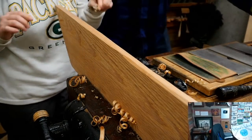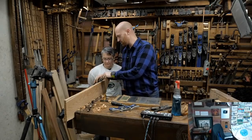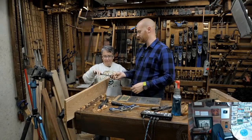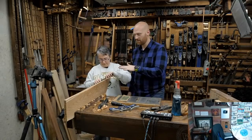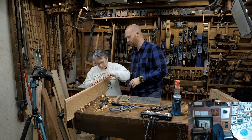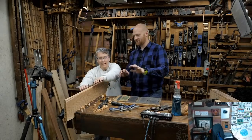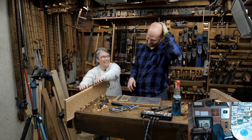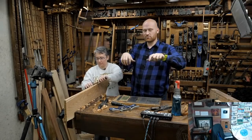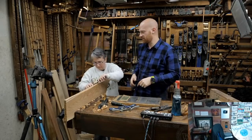And the problem with spokeshaves is they tend to get addictive. Okay. So here, let me show you some of the differences. Because this one, as long as the sole is on there flat and you push it forward, it makes really happy little curls. Then this one's round bottom. This is where the fun happens, because this is far more versatile, but it takes far more control. Like that? Yep. Ooh, I'm impressed. She gets it first try. She's got some control. And I have been married to you for a very long time. Truth. And with a round bottom, you can actually roll it forward and backward. As you roll it forward and backward, you get a lighter cut and a heavier cut. And so getting that angle just right and holding it right at that angle is where the skill comes in.